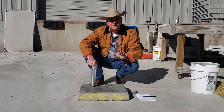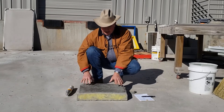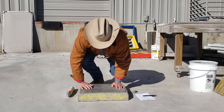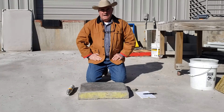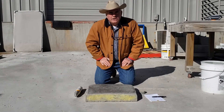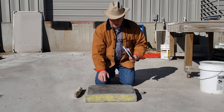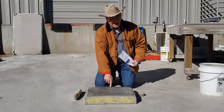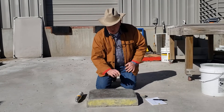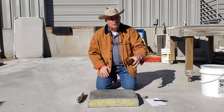So let's look at the next steps in testing — what are the rules? You're going to select your areas. I used a piece of chalk and drew a circle. The circle needs to be six inches in diameter per ASTM C805. Inside the circle you're going to do ten readings and record them — always have a pad and pen out on the job site. You're going to do multiple tests in most cases, so label them. I labeled this one C3 — because it's the Carolinas Concrete Cowboy, that's why. We're going to test and get an average reading. You can have these all over the slab, and that's why you name each one and why I used chalk, so I know where I was.